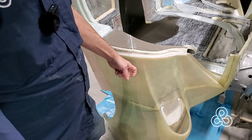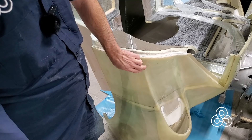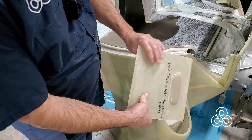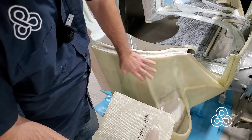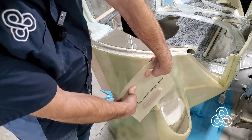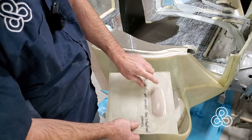In all the videos when we created these panels out of the molds we created them out of six layers of cloth, one of which was a very fine three-ounce cloth to reduce print-through of the fiberglass. Here's a test panel of those six layers so we can take a look at what that is. As you can see there is some flex still, but if there is a flat surface area like on the roof of the car there is a Nomex honeycomb put in. Once you put a core into it, it increases the stiffness tremendously and that is added to any flat surface area.